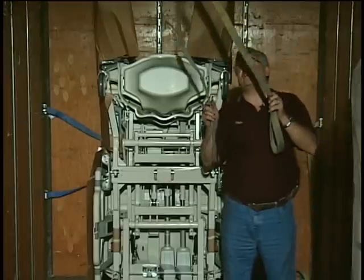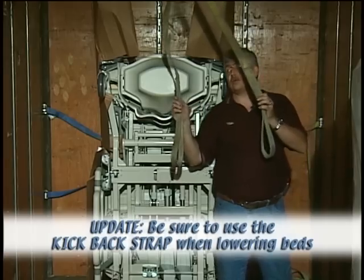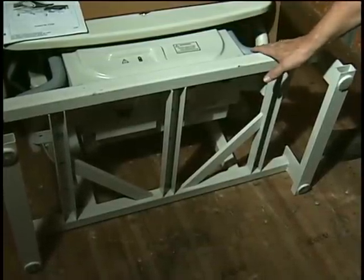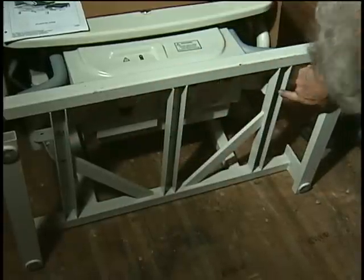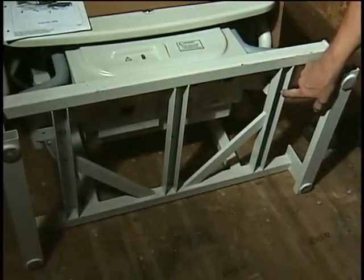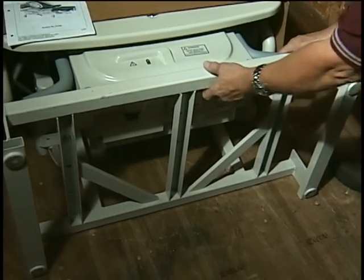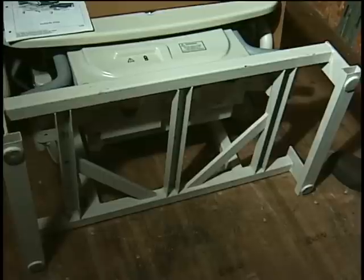On this bed, you'll be using the TotalCare strap — as explained earlier in the segment. Once the bed is down, you have to remove the brace to bring it back to Batesville. You will notice two half-inch nuts right here — you can use a deep socket or a small extension. These come all the way out and do not stay in at any time. Take them out, the brace will come back to you, put it off to the side, and roll the bed out.